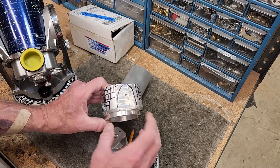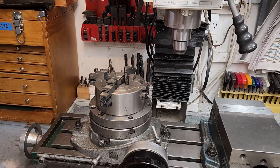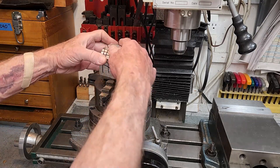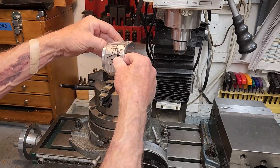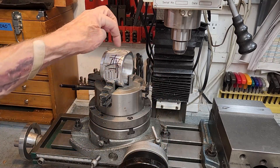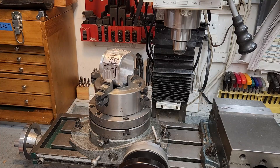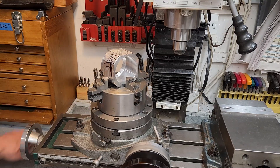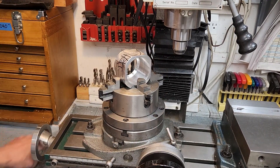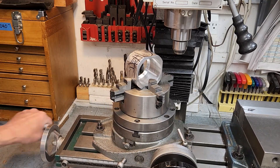I have to be able to hold this on my rotating table. So I'm going to put this part in here, to get this centered and offset the center so that I can rotate around like that. Lock this down and I'll be able to rotate around and mill that off — mill that circular, semi-circular area there.